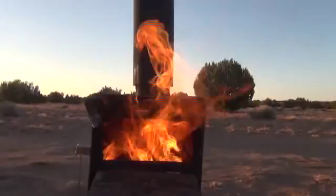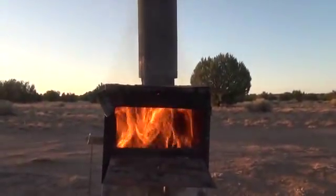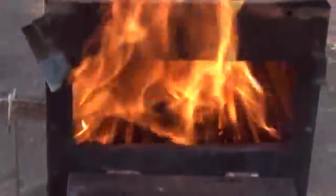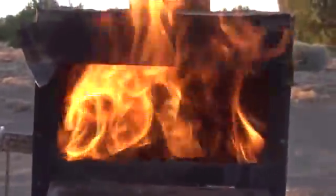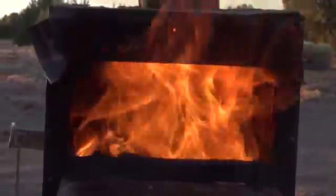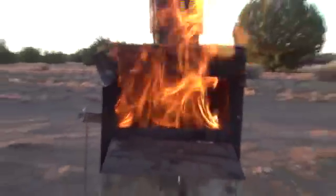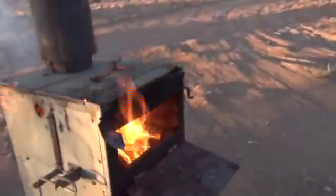That's why you definitely need a secondary burn chamber with a gasifying wood stove, because there's still a lot of fuel coming out at the top. And that's also why the syngas production works. You'll notice here we have an incredible flame raging out of there quite a few feet. What I'm going to do is shut the door down and show you what the holes look like inside. There's an immense amount of heat coming out of this right now for the amount of fuel I just put in. Not only do you get the heat from the syngas production and burn, but afterwards you get a long period of heat coming from the biochar burn. So let me go ahead and shut this door down and show you what it does after that — I've got more energy coming out than I really need.